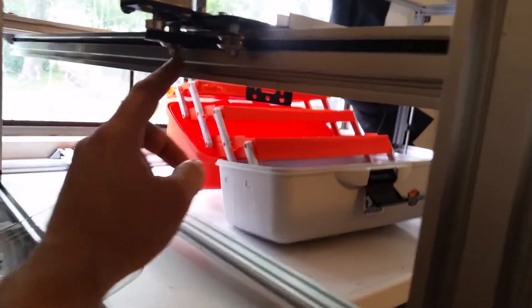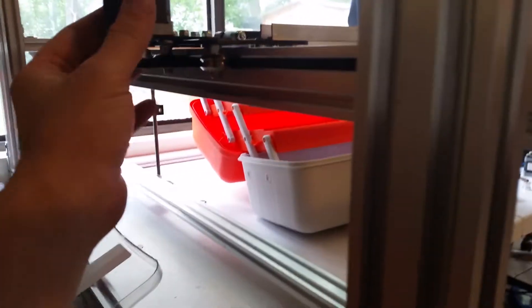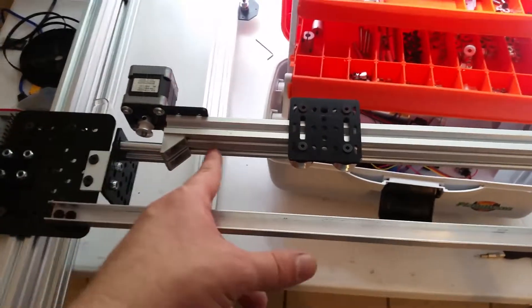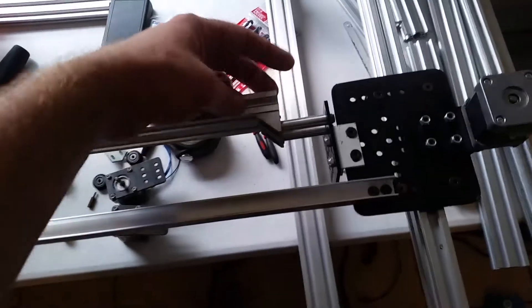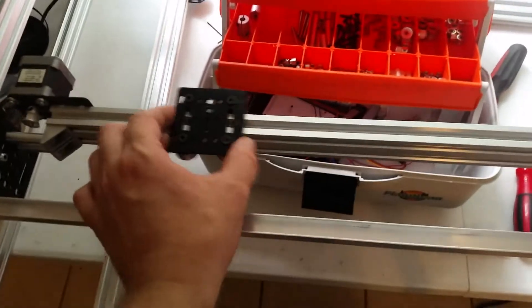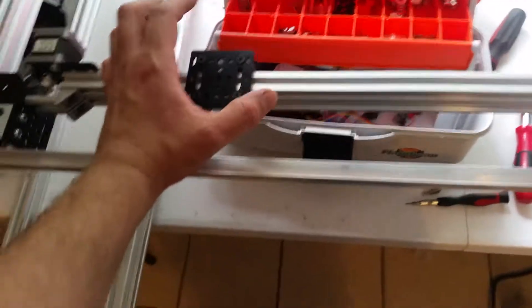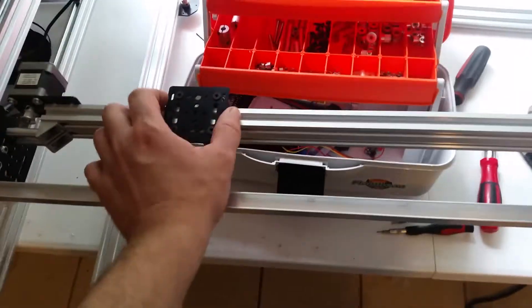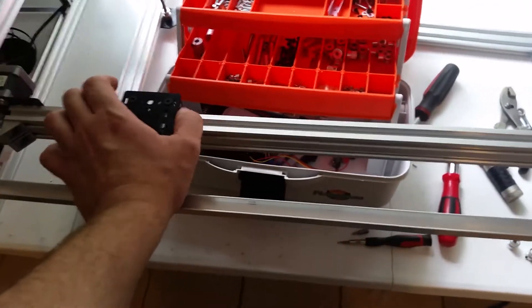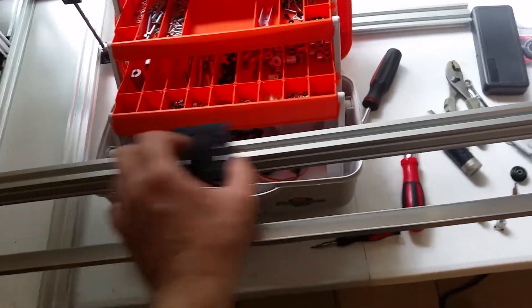The belt rides up over the motor and back down — set up pretty much exactly like I had it on the 3D printer. The x-axis is set up a little differently. There's a belt that loops in through here, goes around the gear, and through the inside of the linear rail. There's going to be a pulley here that the belt wraps back around and connects to the other side. I tried to keep the mass on this part as low as possible because I need speed — I'm hoping to hit at least 500 millimeters per second.